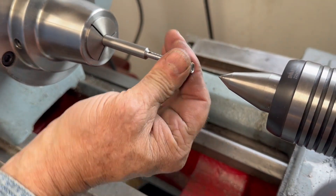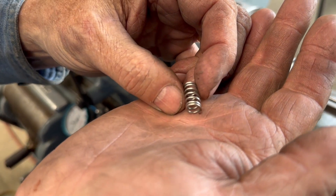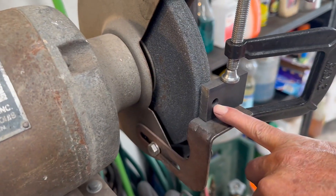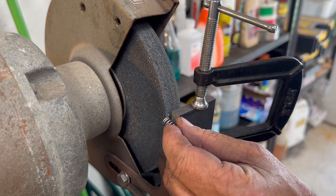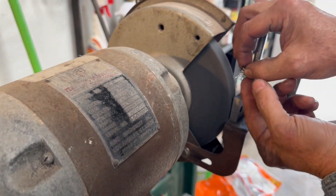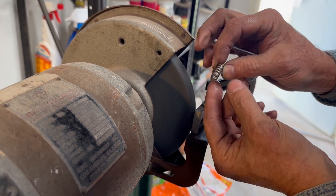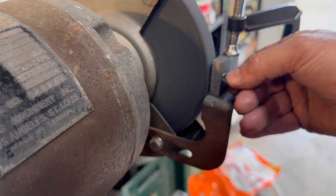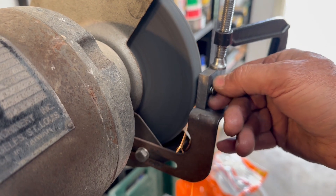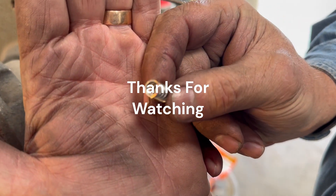Now the hard part is getting the spring off. To do that, I've got to get that little hook straightened out that I put in there, then push up on it. I have to grind that hook off, otherwise I'll mess up the spring if I try to cut it off. You get it down without messing your arbor up and you wind up with a spring like that. But the ends aren't pretty, so then you walk over here where I've got this jig set up with a hole board in it so I can grind the end of the spring. Once I get the tab off, I put it in there, turn it, and you wind up with a ground end like you want.